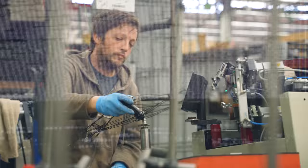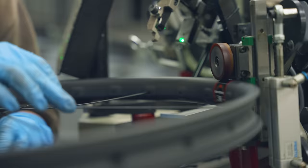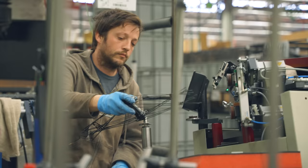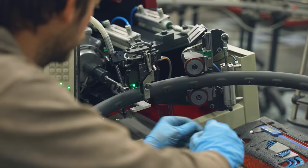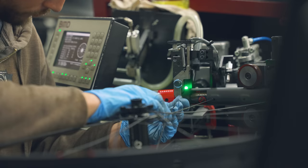Over in this direction are the wheel lacing machines. Kit is using this BMD lacing machine to lace the wheel. He bends all the spokes so they don't get scratched as the rim's spinning around. We typically build wheels to 75% of finished tension on this machine. Kit, who's pretty fast, can do a wheel in about two minutes. When people start out they're about 15 minutes or so, but through a lot of repetition people get good and rip through wheels really fast.